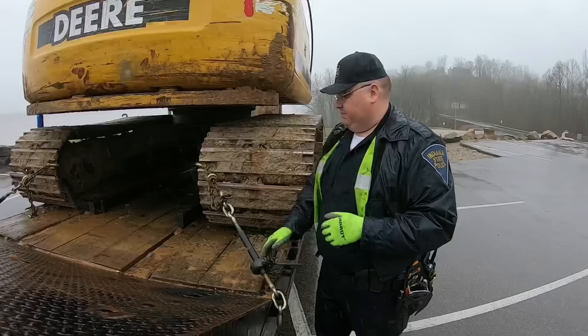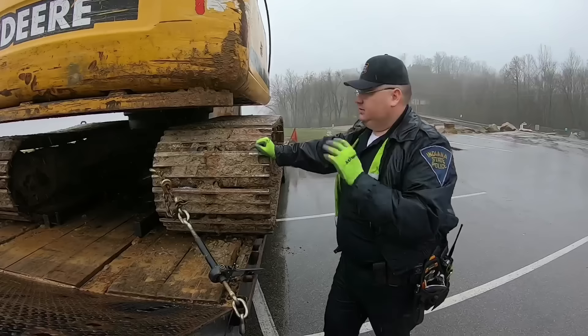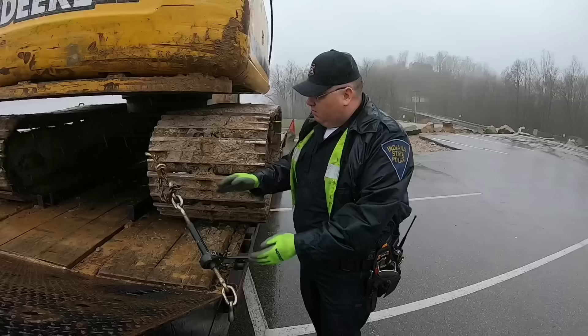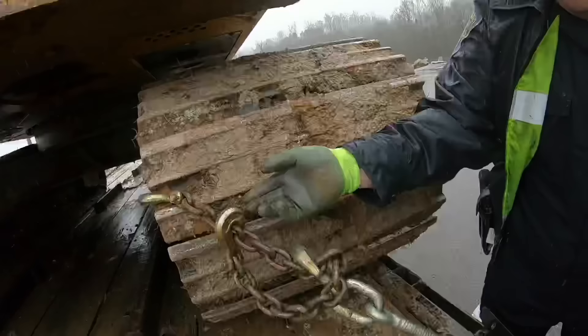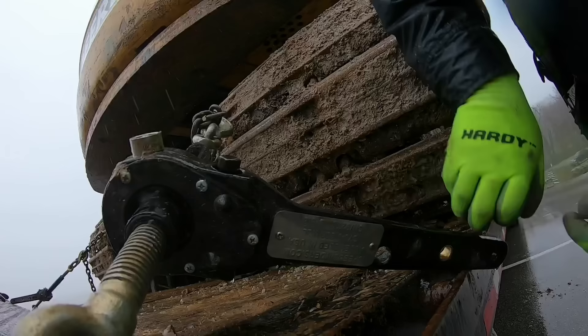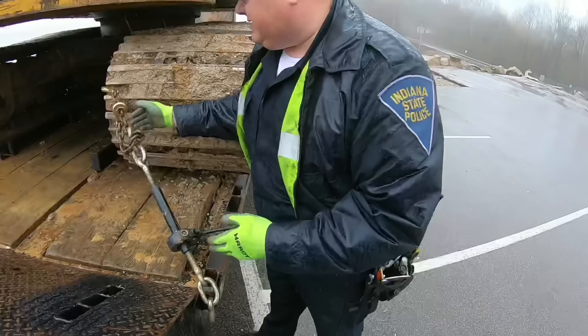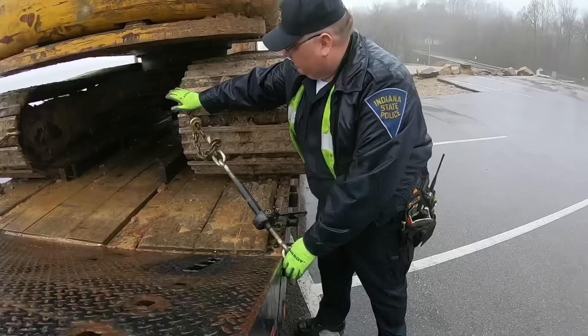Over 10,000 pounds we need four corners, and we need to cover 50% of the weight of the machine. For easy math, say it weighs 30,000 pounds — we'd need to cover 15,000 pounds with our working load limit. This binder here is rated at 9,200 pounds. This chain is Grade 70 at 6,600 pounds. But when something is mounted to the trailer and the item you're securing, it gets 50% of the weakest working load limit — so this chain only gets 3,300 pounds in that configuration.